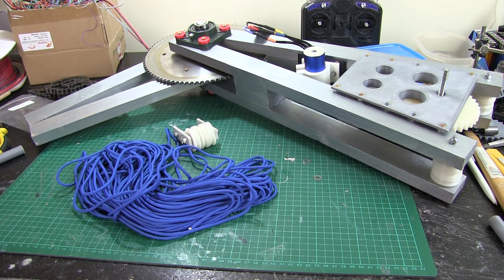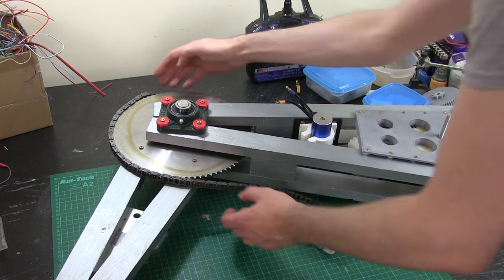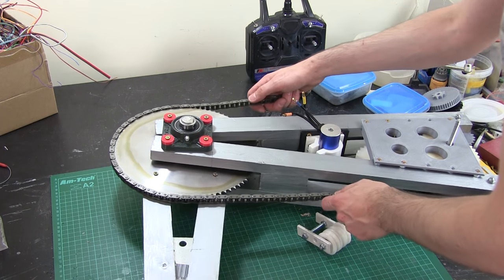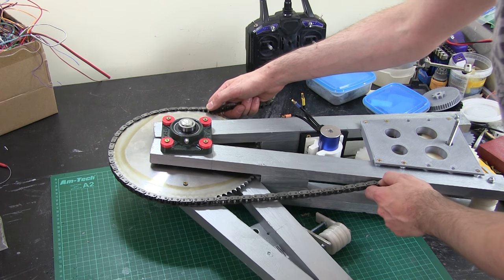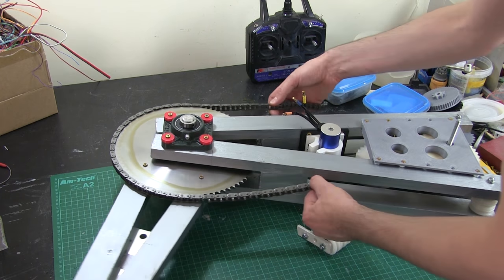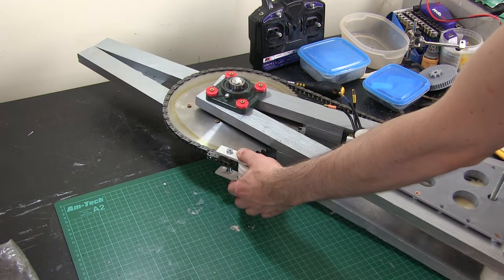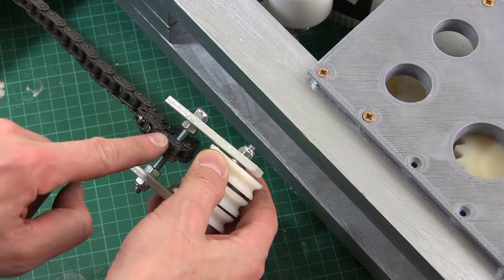This is the outside of the arm — my arm will be on the inside. This chain only needs to start from a straight position because I don't bend my elbow backwards. Realistically it probably only needs to come about that far, and can't go much further because there's an end stop. So it doesn't actually have to pull these chains back and forth very far at all. This is the shortest I can make the chain — I've got a bit of spare there in case I need it. I've bolted the chain to itself here but I can only get M3 bolts through, which might be a weak spot and they might actually shear.